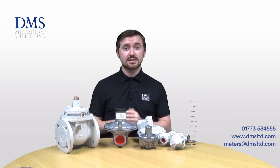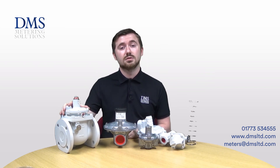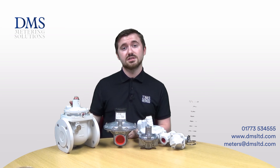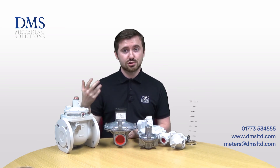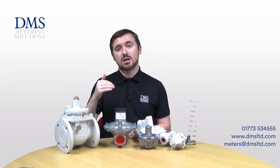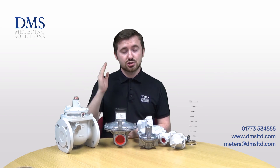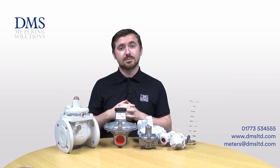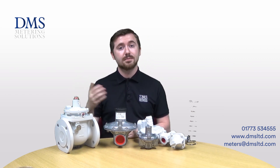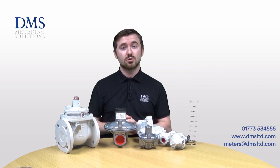The final item we're looking at today is the S100 slam shut valve. These are available in sizes of 50mm, 80mm, and 100mm, all with a PN16 flanged connection. This valve is designed for OPSO use — it will shut off when pressures reach too high a point. They generally work via an external impulse. The line will go further down past the regulators and should everything fail, the OPSO on the S100 will step in, shut off the gas supply, and protect any downstream equipment from dangerous pressures. It can then be reset simply on the top here so the valve can reopen again. It will equalise pressure itself as well, and from that point the system is back open and will continue running.